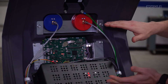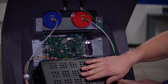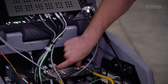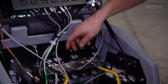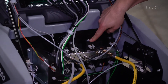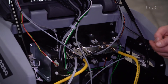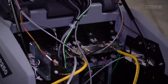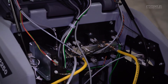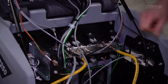Starting from the top on the hood, we've got the logic board that runs the HMI and a power board protected against electrical shock by a cover. Below that we've got our new high-flow manifold, and attached to the manifold we're using AC solenoids rather than DC solenoids, which we find work better — they pull in stronger and are less prone to dirt, contamination, and stiction inside the solenoid plunger.